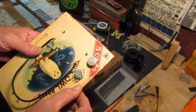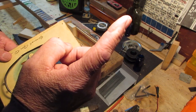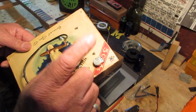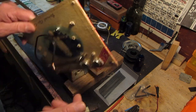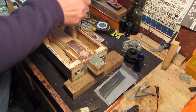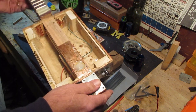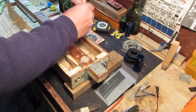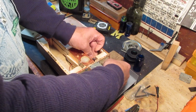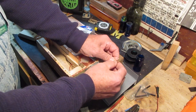I'll show you where the connections go when I'm all done. I've done an episode called 'Wiring a Coil' and also one called 'Wiring a Piezo' - I'll give you the link that pops up throughout the videos. One of the tricks I want to tell you about: I don't put the jack in and then try to solder down in there, because that's a nightmare - probably like to start the house on fire. I take this out, run my two wires through here. I like this pushback wire, especially for the hot wire.